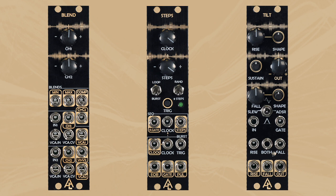do something else. And then Tilt is the multifunction Serge-style patch programmable function generator with envelopes, LFOs, slews, oscillators. And you could also do some weird, interesting PWM with that, if you were to take the rise and fall outputs and trigger audio rates and play around with CV over rise and fall times. You could do some really interesting destructive audio with that one.